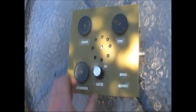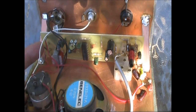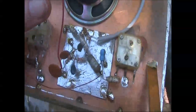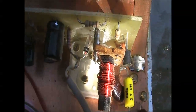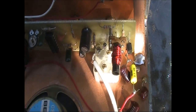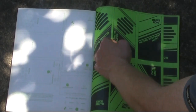This is a real live Funway 2 kit, though it looks nothing like it since I've done extensive modifications. You can see the original printed circuit board where I'm pointing to. The original was a straight shortwave receiver — basically an RF amplifier, diode detector, audio amplifier, and a speaker transformer. What I did was modify it to form a direct conversion receiver. I added a local oscillator free-running on 3.5 to 3.7 MHz covering 80 meters, then modified the diode detector by lifting one end of the diode from its tracks, providing a mixer and forming a very basic direct conversion receiver. The performance on 80 meters is surprisingly good.